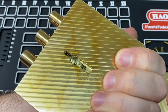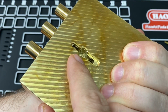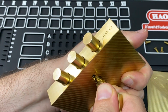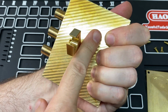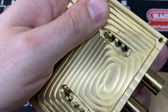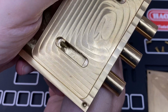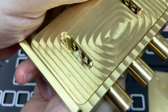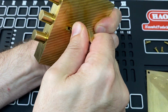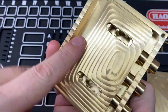So here's the key. You might be able to see down in there into the keyway that there are things for this key to lift up. Indeed there are. So put the key in and turn it. I have to get this exactly to 90 degrees like this. And when you do that, you're lifting all of these wafers out of the way. So that's locked and that is unlocked. You can see that you need to clear all 6 wafers, 3 top, 3 bottom, before this lock will slide to the, well, in this case right.